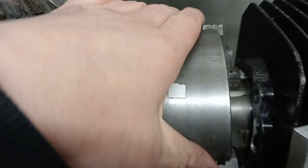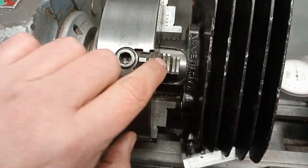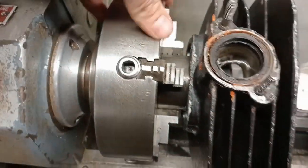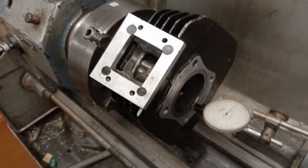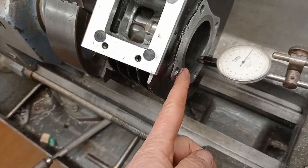Okay, it's my setup. I used the centre in there. If you can see, there's a lump of metal which is 54.5mm or 55.5mm — 55. It's clamped with two of the four jaws, and then on the bottom of the liner with the other two. I've got it to within about half a thou, which I think is good enough. I'm going to then turn it, have this centre in here to support it — it's a little bit out of balance but I'll do it slow — and then I'll just take some of that off.